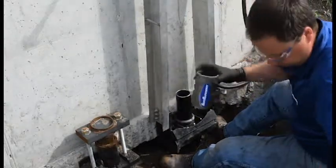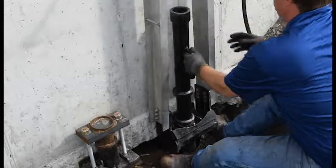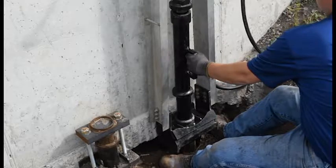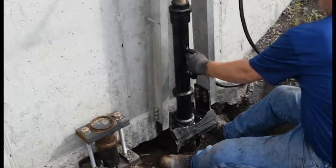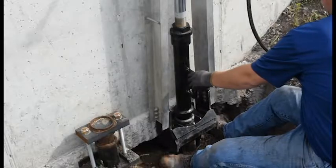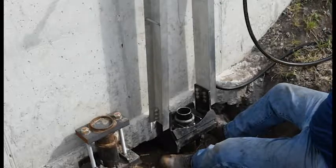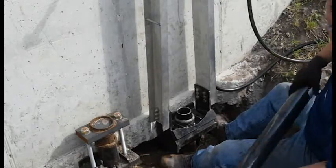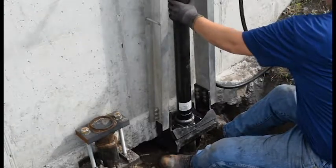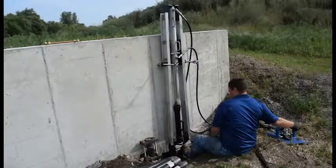Now the cut-off guide can be removed. Now we'll go ahead and finish driving the starter tube. I don't have any blocking and the frame barely settles when pressure is removed. Now we'll just drive pins like we would on any other pier until we reach pressure.